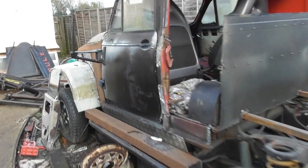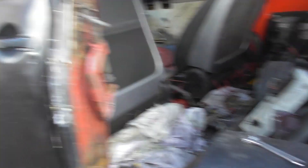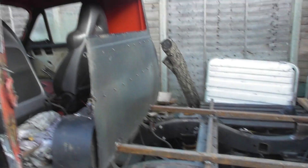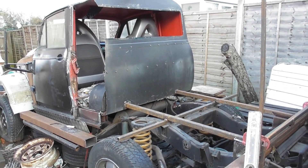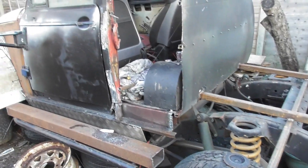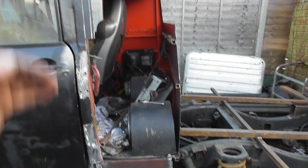I'm still not dismissing the wood side of it as yet. What I'm thinking is angle iron on the outside, and the flat piece will be on the inside. We'll use the box steel we've got and quite literally weld a piece of metal on the inside edge all the way along, then put the tin in, and the wood can sit on the outside against the steel supports - it might work, you never know. I don't really want to cut the metal in half, but I don't really want to do the whole bottom half in wood either. So I've got a lot of figuring out to do. I might just go angle on the outside edge.